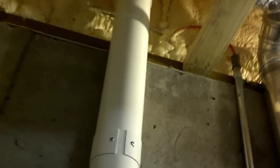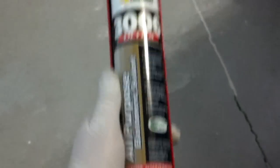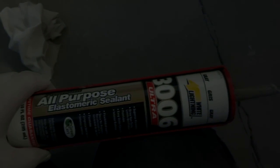You're not going to see a lot of pictures of myself and the family doing the work because it's hard to hold the camera at the same time, especially when you're kind of DIYing this project. At the base we're going to seal that in so the pipe can't move at all and we'll seal all the cracks. As far as crack sealing goes, basically find as many cracks as you can and seal them up. They tell you that you only have to do within 10 feet of where you're pulling the air, but I did the whole entire basement. There's a crack that was put in on purpose — a piece of plastic down there to help the concrete crack when we poured the floor. I got some 3006, basically a really good sealant made out of elastomer silicone, which allows it to stretch and move with the floor as it moves throughout the winter and summer seasons.